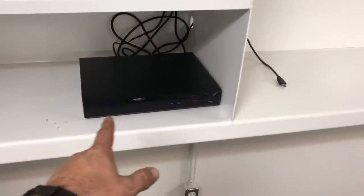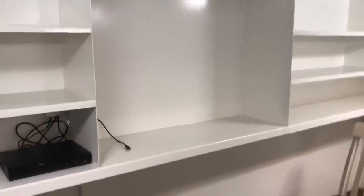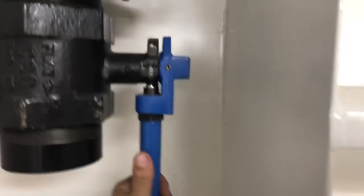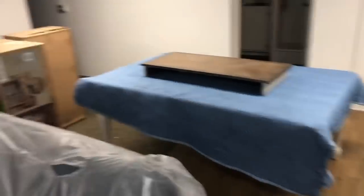This is your brain box for your cameras. You need to get a TV — this is 12 volt, connect the HDMI to the TV which will plug in here, and mount the TV in here. This is your air out. Remember: when the handle goes across the valve it's closed; when the handle is in line with the valve it's open. So for right now we'll close it.